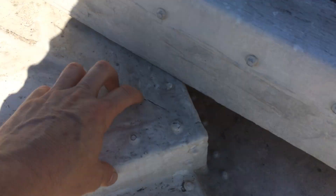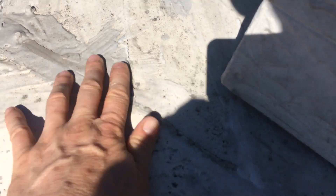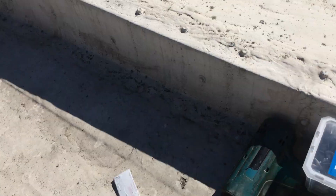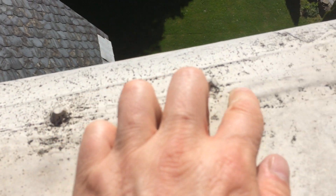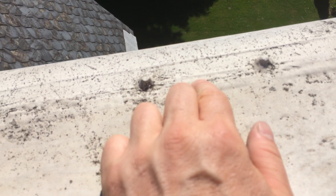Right away I noticed this — right here. These are the things we want to look out for: any place where there's too much wood movement causing a fracture starting. The other thing I'd like to look out for is anywhere we have aluminum on the gecko, like where we put screws down to hold everything. Sometimes, like right here, you see that move — so maybe I should put another screw in there to make it more stable. Along this edge, this is all like an aluminum edge, and then this is the aluminum drip edge here. You want to check all these spots if there's a fracture line forming and it's not stable enough — you need more screws.